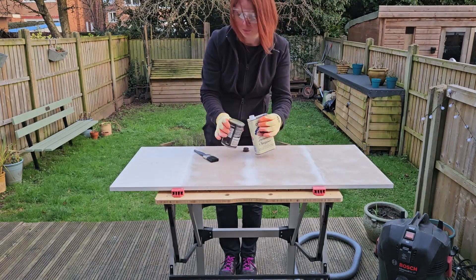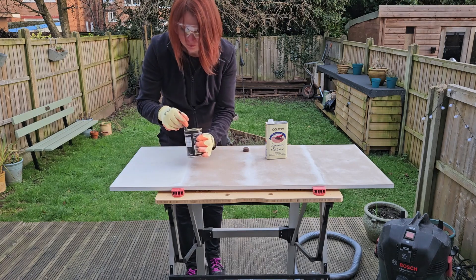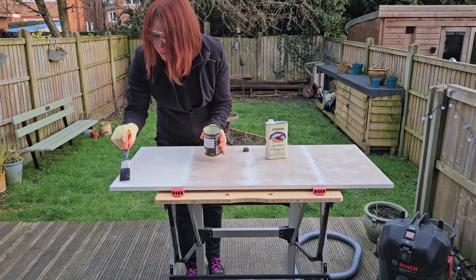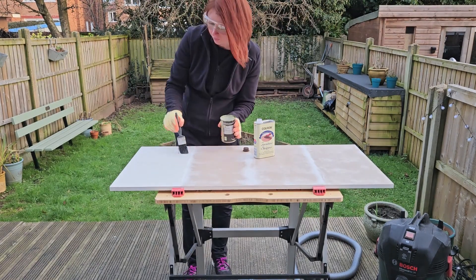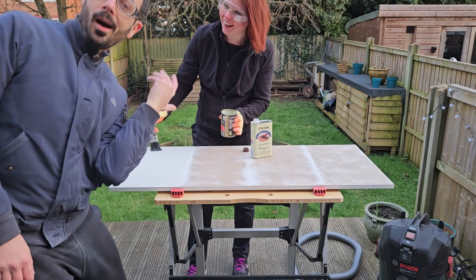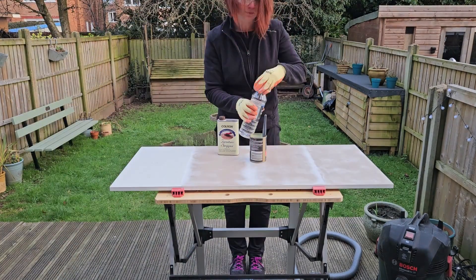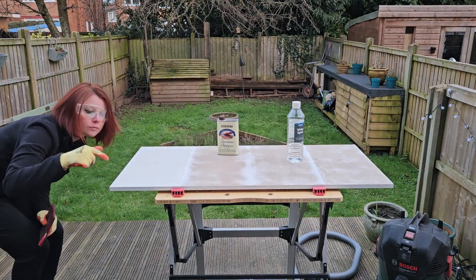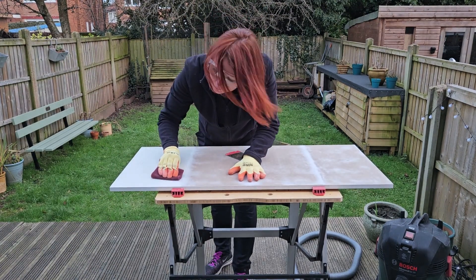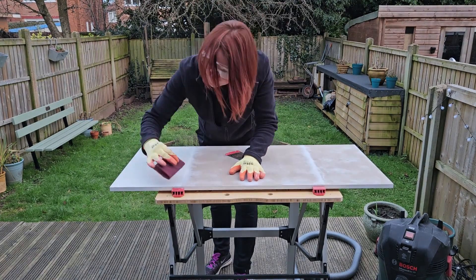For the fourth part of the experiment we're using a type of paint remover. Apply liberally — it will help. I don't have PPE on, but be aware that because of the fumes it is better to be done outside or in a well-ventilated space. Cover it completely, just be careful not to put too much around the edges — you need to protect your edges. Keep your brush clean between coats. As instructed by the product, leave for 30 minutes, then come back and give it a go.